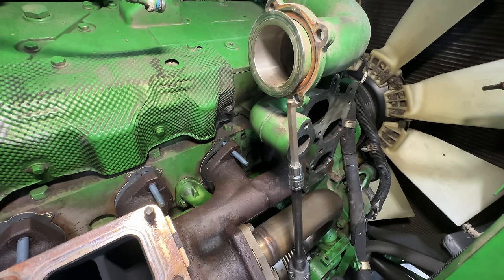And I use this for completely drilling out bolts to where there's hardly anything left, and then tap out the hole. But this is a rescue bit, got off Amazon. And it is meant for drilling out screw extractors, easy outs, broken bolts, taps, drill bits. I mean, it's harder than woodpecker lips. I spin it about 25,000, 30,000 RPM, and it will eat. So the main reason I got the rotary tool is for drilling out bolts and broke off extractors, stuff like that. Okay, what do we got next?